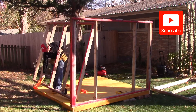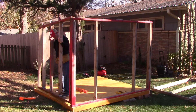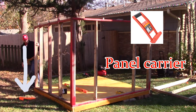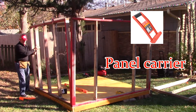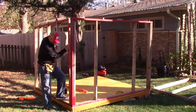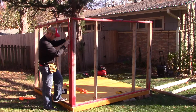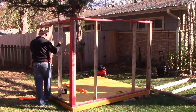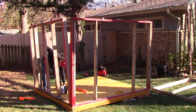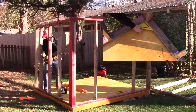Here I'm putting on the next wall, which is going to be the north wall. It's a little more cumbersome. You can see I'm using that bright orange tool, which is designed to help carry these types of walls. All I need to do is get it nice and snug, get it flat on the surface of the platform, then put a single screw in it to keep it stable. I'll connect it to the next wall, and I do use a speed square to make sure it's actually squared before going any further.